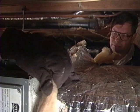He then uses a fiberglass mesh tape around the entire connection. Finally, he paints this surface with mastic. After this connection is sealed, it's important to secure the insulation. This contractor holds the insulation in place with a UL-181 foil tape.